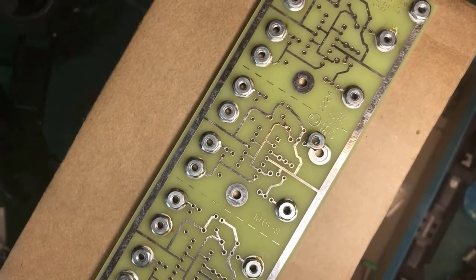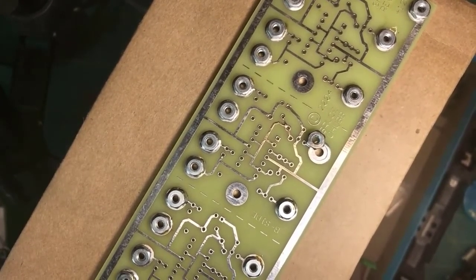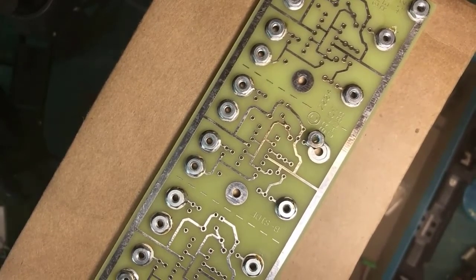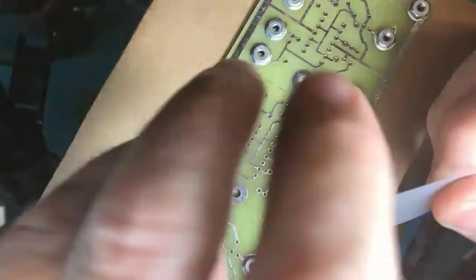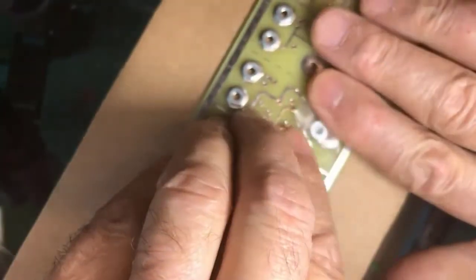The other question is how many soldering irons do people have, right? So I actually have two. I have a gun style for big jobs that have to heat. And then I have an electronics temperature controlled one with a temperature gauge where you set it based on what solder you're using. Now, your gun, sir, how many watts is that gun?